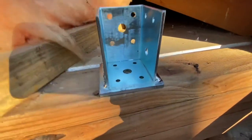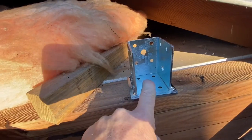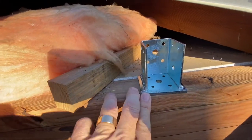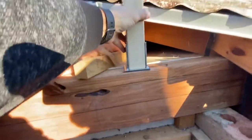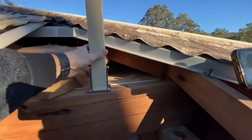You can see that left-to-right horizontal timber section there — that big thick piece of wood — that's where we're going to fix this. The bracket sits on top of the top plate. Inside the bracket you'll see a bunch of holes: one big hole in the middle where you can fit a coach screw, and also two timber tech screws, as per the engineering. Once that's fitted into the top plate, you can fit the post into the bracket to get your roof penetration.